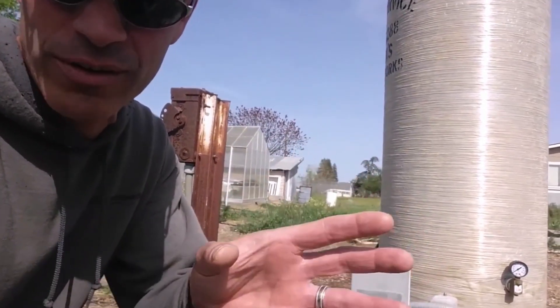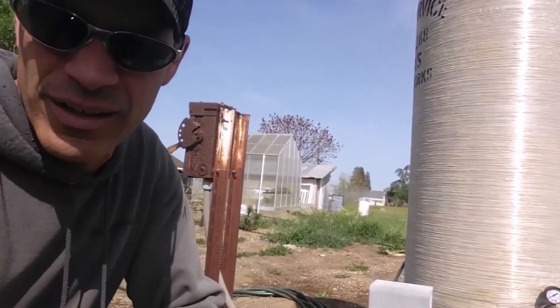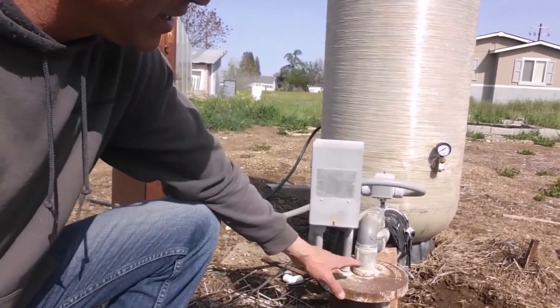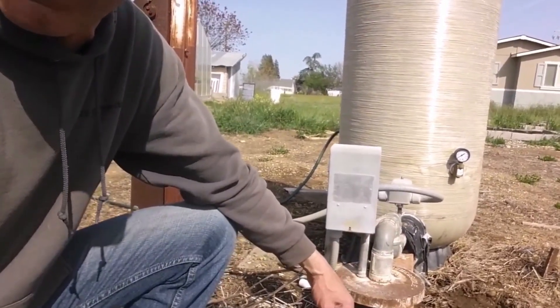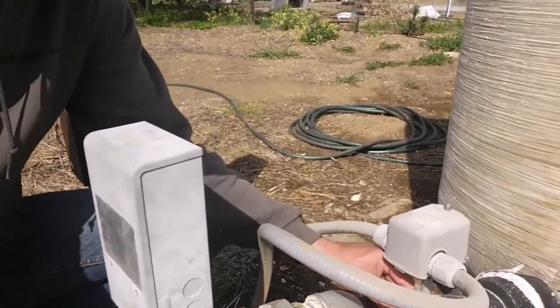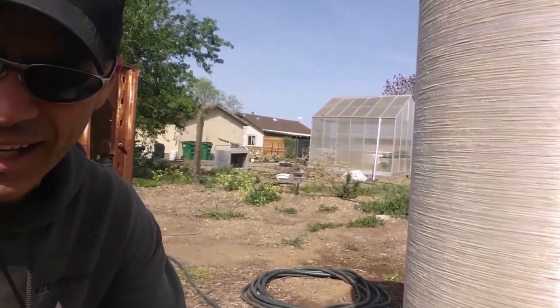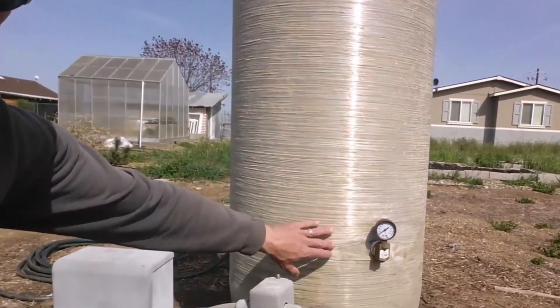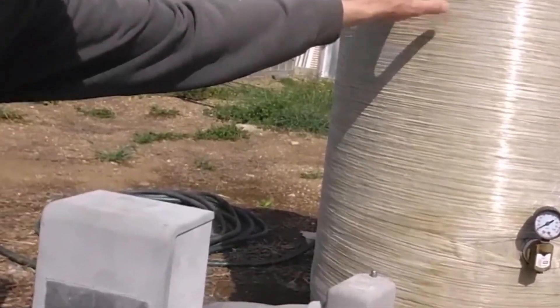While the tank is draining, let's explain a little about a conventional well system. In the tank you have potentially half water and half air. You can't compress water, so in order to keep the pump from cycling too often you need air as a cushion. In the well itself there's a weep valve — every time the pump cycles it lets water out of the pipe so it fills with air. On the top you have an air valve which lets air in after the pump cycles. Too much air isn't good either — if you're taking a shower and air comes out of your shower head, that's not good. So this system also has an air control valve that lets excess air out of the tank if it becomes overly charged.